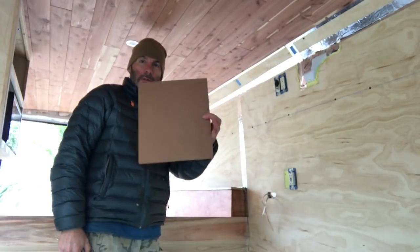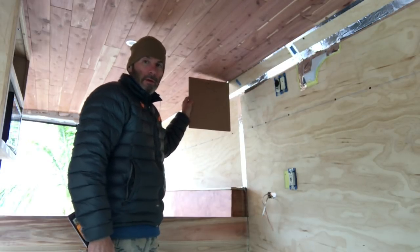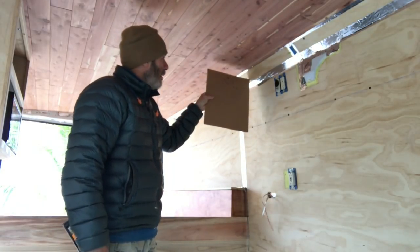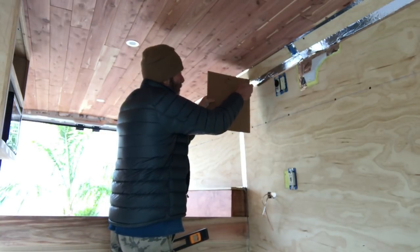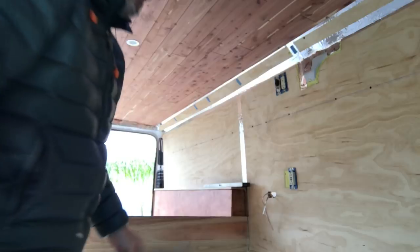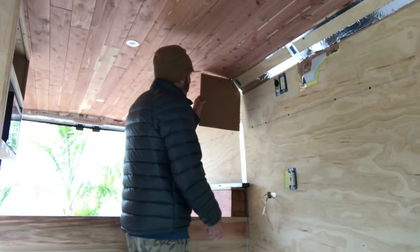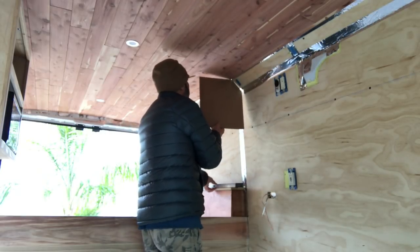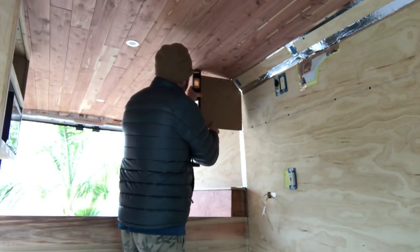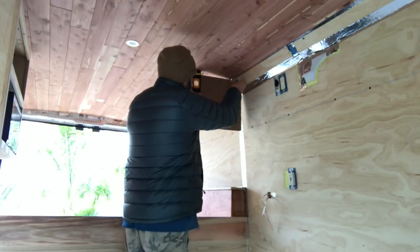Just to show you again — this is just a square piece of cardboard cut out to the rough dimensions. This is a DVD cabinet that's going to hold DVDs here and then books right here. So the first line is right here and you can see it's way off. What you do is just start to get rid of some of the obvious excess and then it just starts to whittle itself down into the spot. You can kind of start to see the shape coming up. So now I have a compass, and you just set that to the widest part. It's got to be plumbed first, so you plumb it up and watch the little bubble.